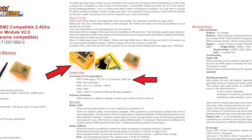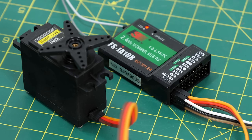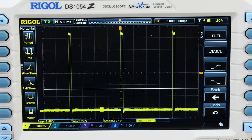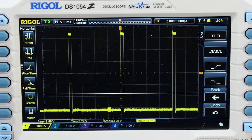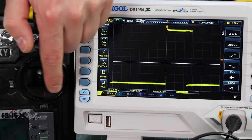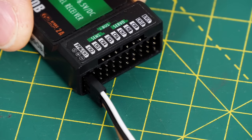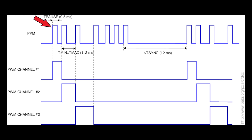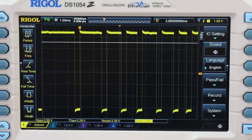Before we can use it, we need to look at what PPM is. Most older style radio receivers have a socket to plug servos and speed controllers straight into. This signal is Pulse Width Modulation, or PWM. It looks like a square wave with varying lengths of the signal being high to control servo position or ESC speed. The pulse lengths are typically between 1000 and 2000 microseconds. PPM is very similar but instead of a connector and signal wire for each servo, there's just one wire with all signals on it. The standard is around 500 microsecond pulses, with the time between the rising edges of two pulses being the servo pulse width to send. Each channel's value is sent one after the other with a longer gap to show where the start is. Looking at the PPM output of my receiver, the whole thing appears inverted — the signal is high most of the time with shorter pulses going low.